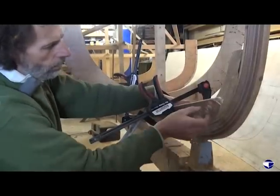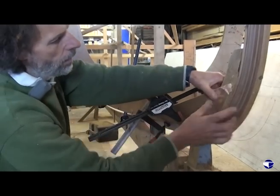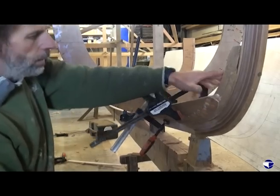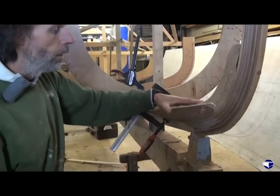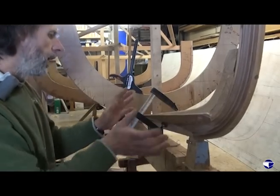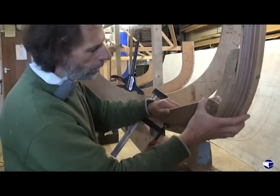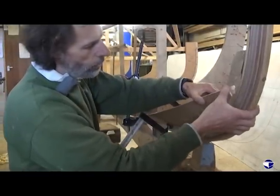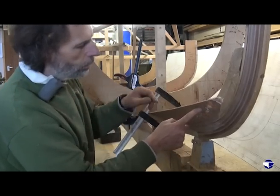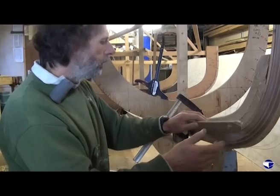What we're going to do is use our hot melt glue gun and some little sticks of timber to stick onto our plywood and to take us out to where our rebate is. In order for it to be a reliable pattern, we just want to make sure it curves up into place in a nice fair way — no kinks and bulges in it — because that's what our plank is going to do later on. So it's good to just push it into place so we're not pushing it down, not pulling it up — it's just bending in where it wants to bend in.